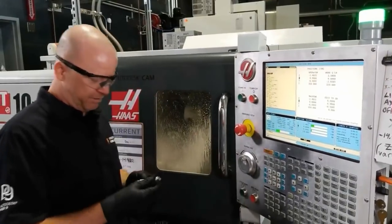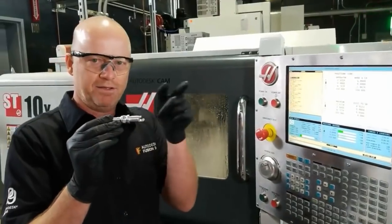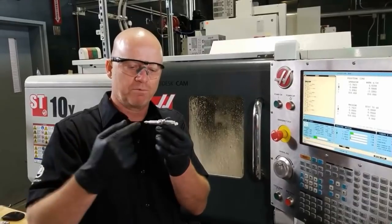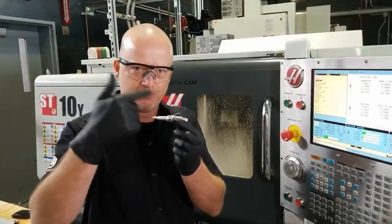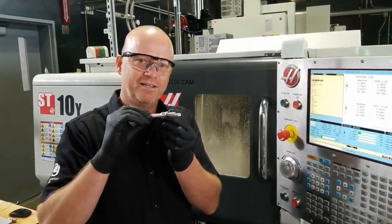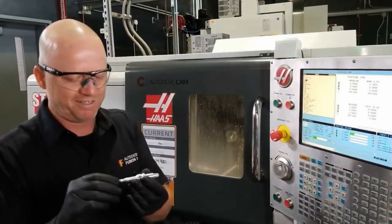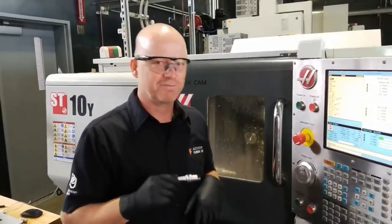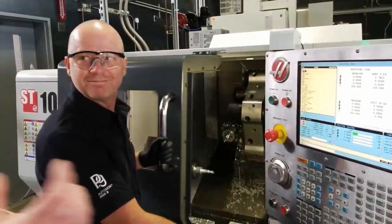All right, now we've finished all the work in this front section, and this is all solid stock. Now what we're working on is this portion where my finger is, and we're going to machine all of that, rough it out, and then finish. Then we're going to leave this still rigid and solid and work on that in another segment. That's a technique I use because if you were to turn all of that, this thing would be flapping in the wind and the finish pass wouldn't be ideal, to say the least. So you broke it into basically two chunks.